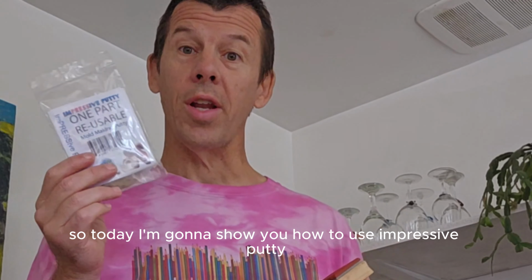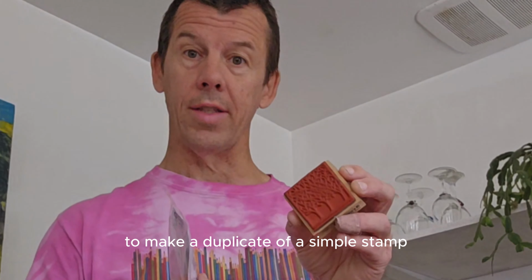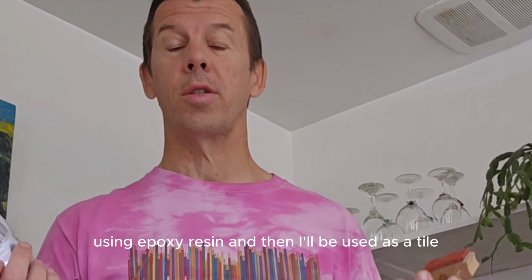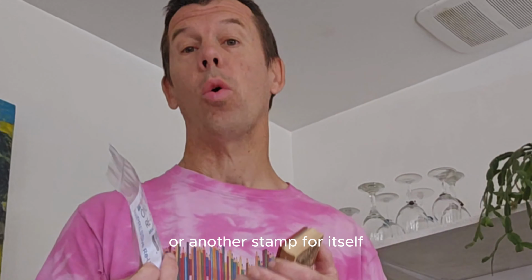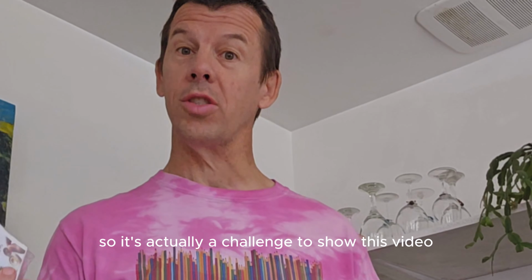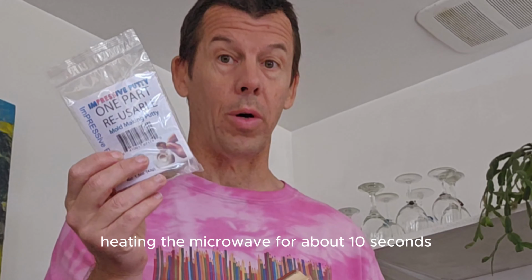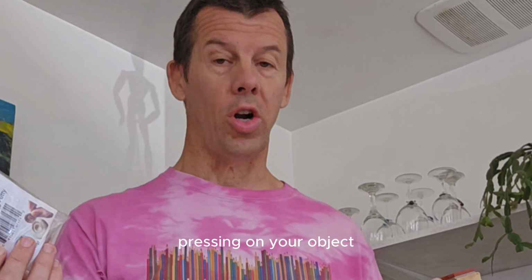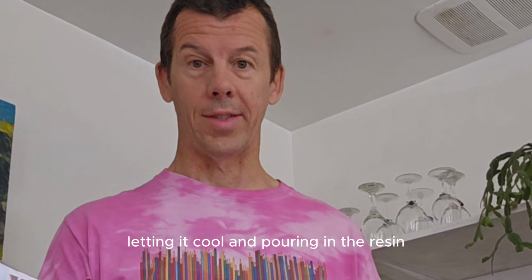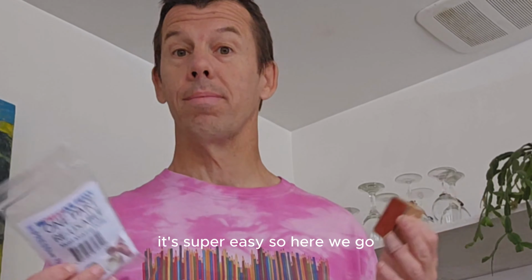So today I'm going to show you how to use Impressive Putty, a reusable mold making material, to make a duplicate of a simple stamp using epoxy resin, and that'll be used as a tile or another stamp for itself. The process is super simple, so it's actually a challenge to show in this video, because the process is simply taking this, heating it in the microwave for about 10 seconds, pressing on your object, letting it cool, and pouring in the resin. And that's the whole process. It's super easy. So here we go.